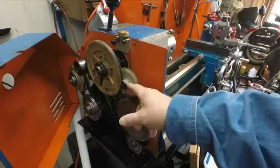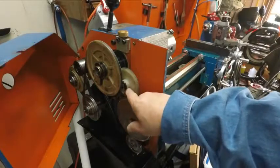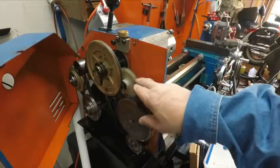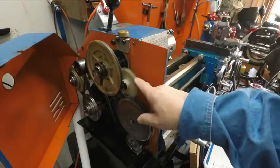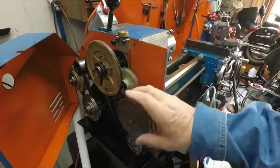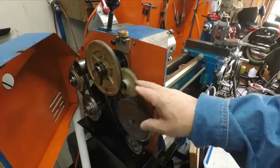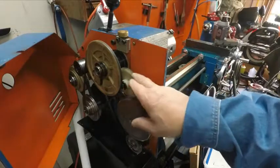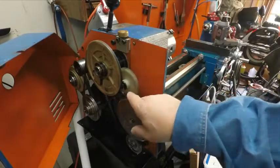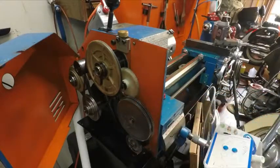It's a flat gear, and then it comes out here, and it's got a protrusion here, and it's got a keyway in it. This will be machined, I think, the teeth off of the lathe, because when I tried to pour it, these teeth are so fine, they don't want to come out of the mold right. So I'm figuring how to cut the teeth on the lathe, and then bore the hole through. Then I can put the keyway in just by hand.